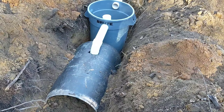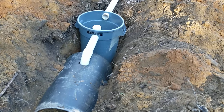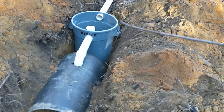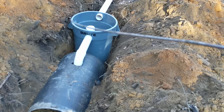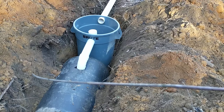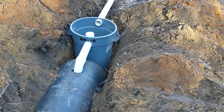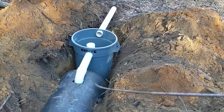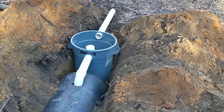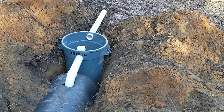So, I got another video on a grease trap that you would want to run your gray water through, your showers, your sinks, kitchen, your wash machine, which collects all the grease, all the food, all the shampoo and soap, all the solid hair and all that. It collects it in the tank and flows right up onto the ground. Anyway, that's a 5-gallon bucket with 2-inch pipe and 2-inch fittings. You might want to check that out. So if you had this for the toilet and that grease trap for the gray water, the rest of the house, then you can run your whole place off of that.